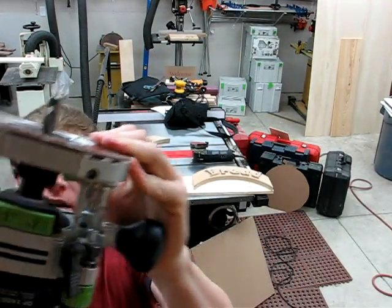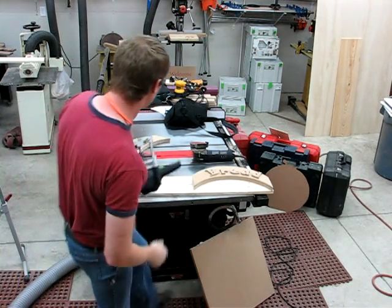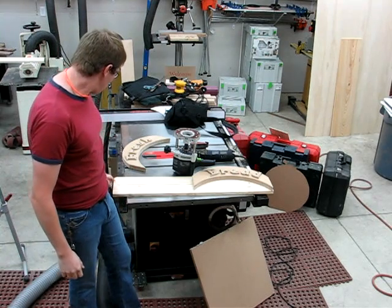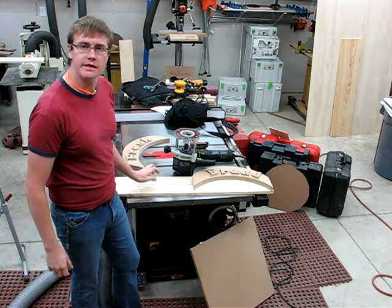So, to get rid of that, I'm going to go ahead and use my OF 1400 here with just a straight cut fluted bit in it. I'm just going to do the rough cut with that, and then go back with the RAS and smooth it out to the contour of our arches here. So I'm going to get going on that.